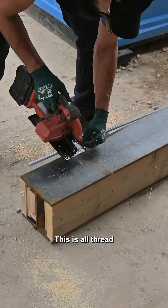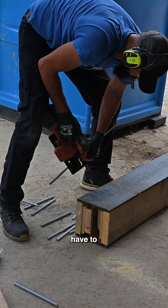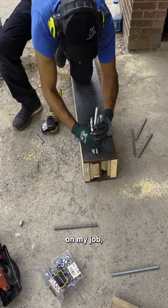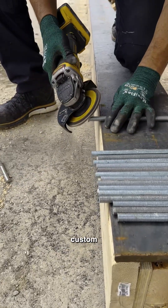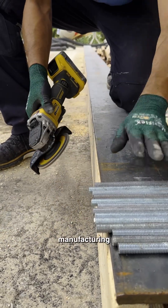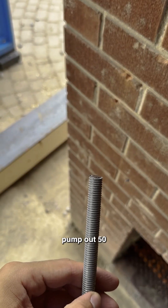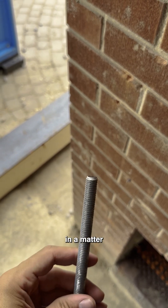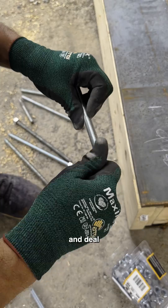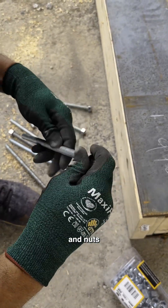Here I'm making my bolts. I always chop bolts from all-thread because then I don't have to carry a bunch of different sizes - I just bring all-thread and custom make all my lengths. There's a little bit of manufacturing involved, but I can pump out 50-60 bolts in a matter of minutes instead of stocking all different sizes. I'm just stocking all-thread, washers, and nuts - all grade-5 zinc-plated.